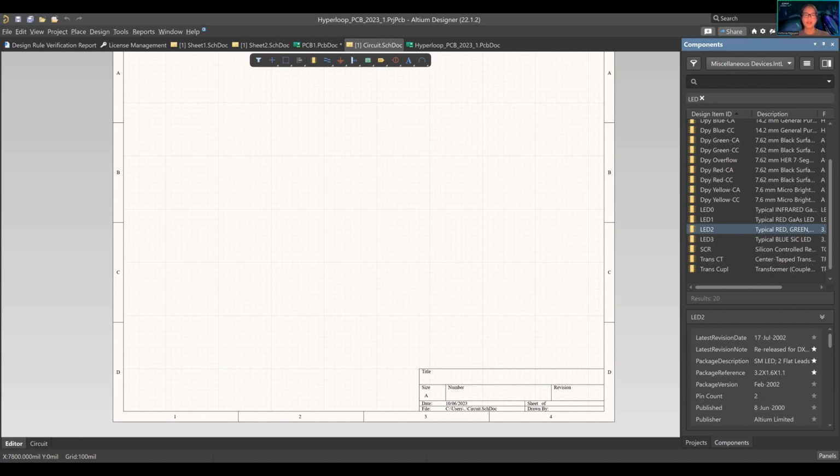Okay, so let's play with the first one. How do we find your capacitor? Components panel. Is a capacitor a device or a connector? Not a trick question, it's a device. So let's go to your capacitor. Over here you can see capacitor; Cap is the ID name for it. What you do is left click and grab on. Then you have your component. This is called the component, this is the ID number, this is a reference designator, and this is the value.